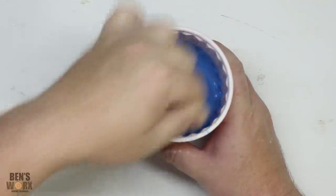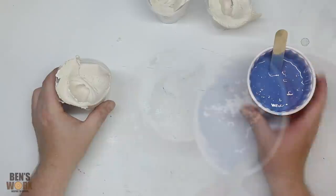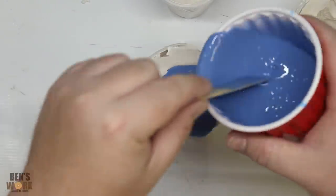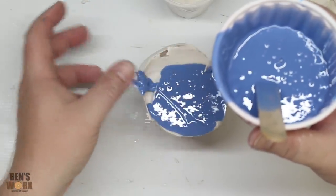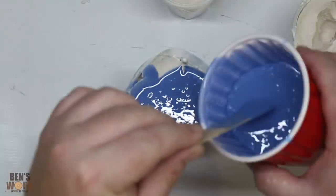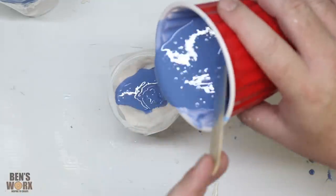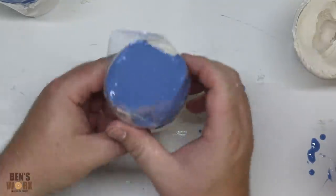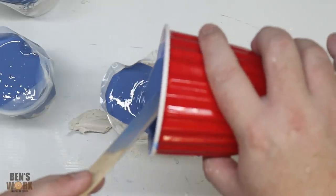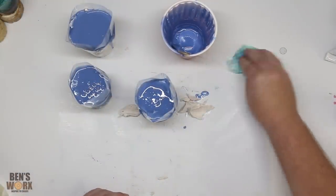I haven't done too much work with silicone rubber — this particular one has a Shore A rating of 37 to 40, which basically indicates how strong the mold will be. I'll insert a picture so you can see what the different numbers mean. With it being a one-to-one ratio, I'm just going to pour equal parts into smaller cups then combine them to mix. I really hope this works — I don't want to have to stick my tongue in that stuff again. That looks like it's mixed pretty well. Let's pour it into the molds. Whoops — I didn't realize the side of the cup had disappeared. That hole we blew in the side — it's all leaking out. That's not going to be very good.